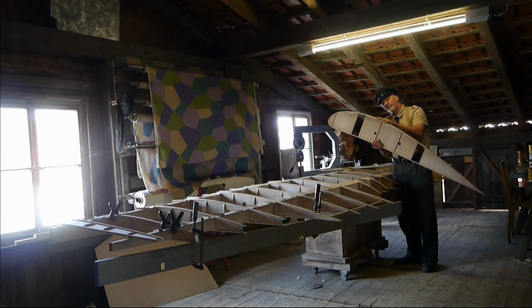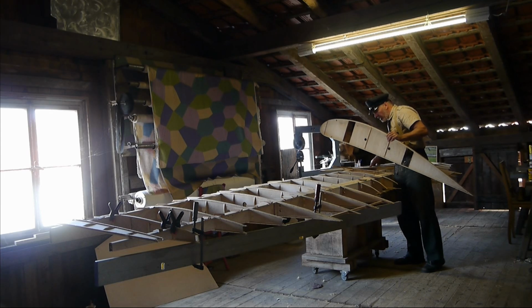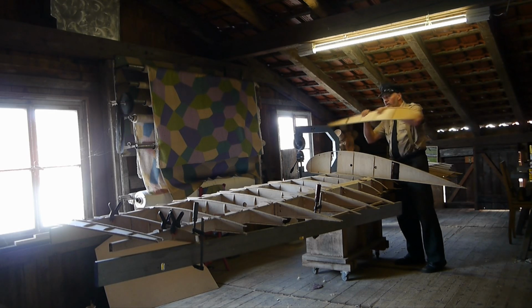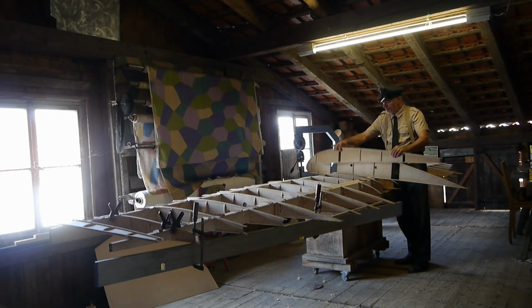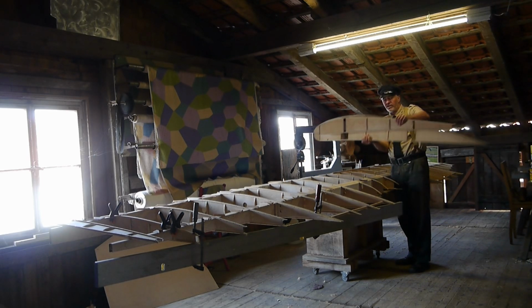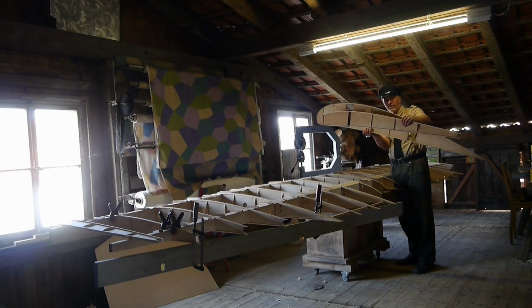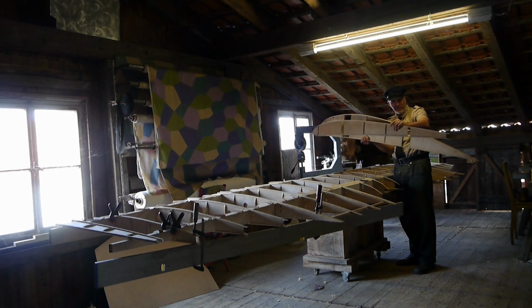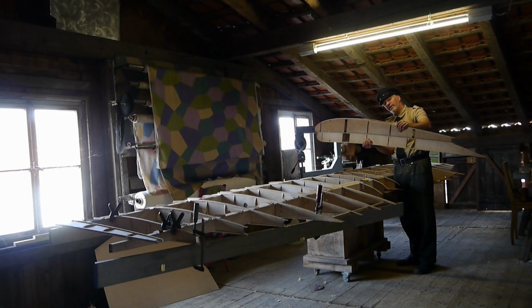So, to counteract this, flat profiles, as they used to be, are turned outwards, i.e. their setting angle is changed. This twisting causes the flow to break off on the inside first while it remains constant on the outside. This means that my lift remains constant here and the ailerons on the outside remain effective for longer.